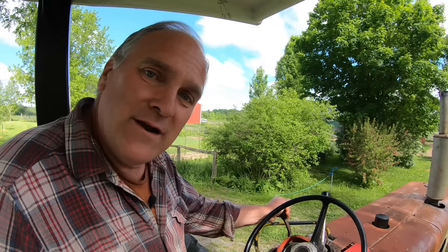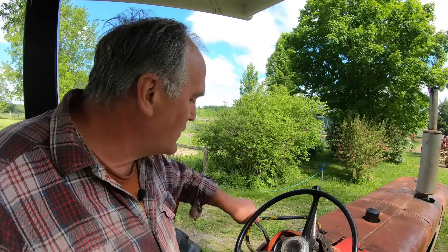So it's cheap horsepower considering what you'd pay for a new tractor. What is super about this tractor for haying is that it's hydrostatic drive — it was the first large hydrostatic drive tractor. Hydrostatic is what a lot of little lawnmowers use now where you push down the foot pedal and the more you push it the faster it goes. You just move this lever forward and you go faster; go the other way for reverse. In haying you often hit a high spot or low spot and want to adjust speed, and with this tractor you don't have to push in the clutch and change gears — you just move the lever. Super for haying.